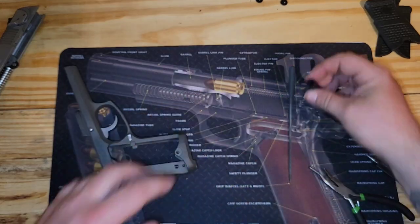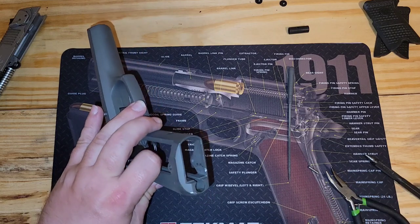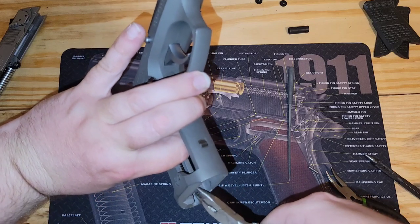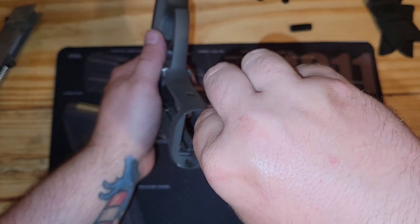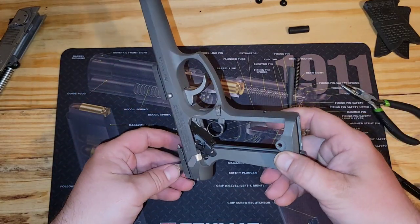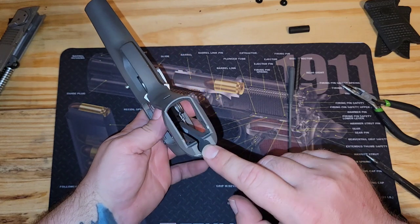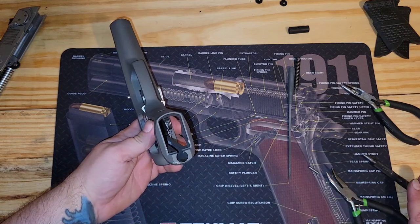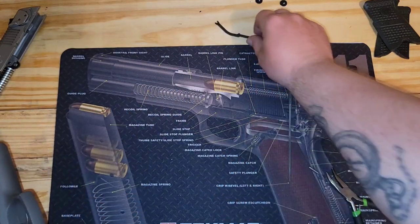Now two things here — you got a little metal piece in here, don't lose it, so we'll set that to the side. I'll reach in with my other pair of pliers and grab this spring real quick — it's kind of hard to do while I'm looking through a camera, but there we are. We also have our little hammer arm here. You want to try not to let that come out of the gun because it's a pain to get back in.